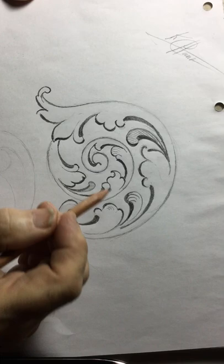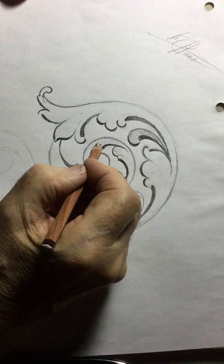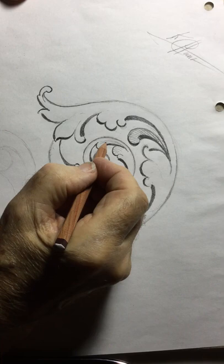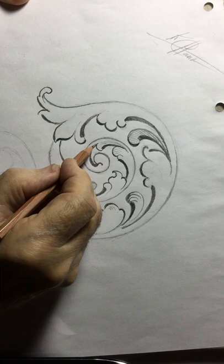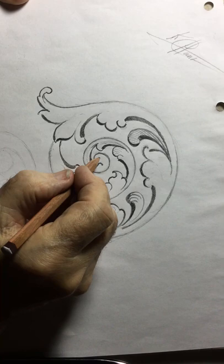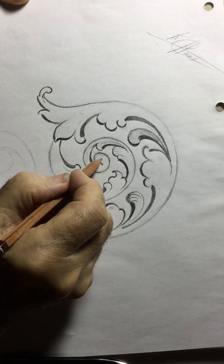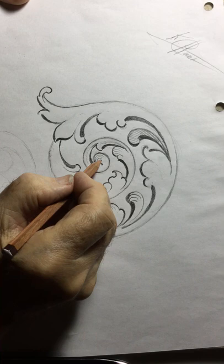It just gives a little bit more variation. So you vary your scroll as you go along. I'm doing it like you were doing it — so we would put the graver in and set the cut back here, then do a little bit over there. Don't overdo it. It's two lines — all it needs. And if it's small, keep it fine and keep it neat. I'm trying to emphasise that with your graver, you treat it like a drill — it could be like a drill that you drill up the road with, or it could be like a dentist drill, something very fine.